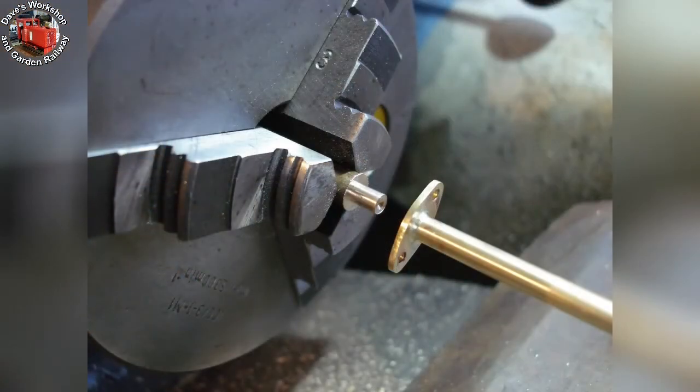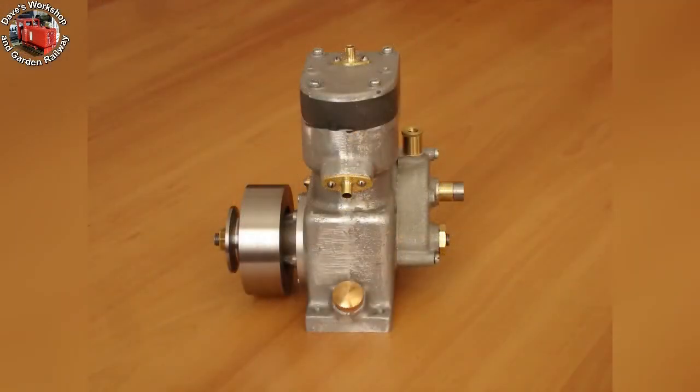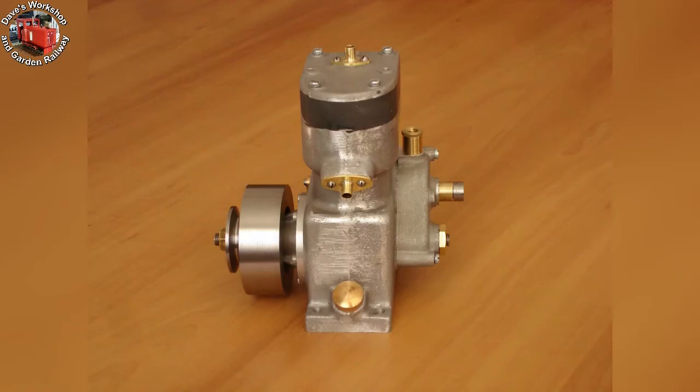This is one of the cooling water flanges, about to be super-glued onto the shaft so that I can part off the excess tube and face it to length. Water inlet and outlet flanges fitted. Brass oil filler plug fitted — it was a lovely turning job using that knurling alternative, with the end domed.